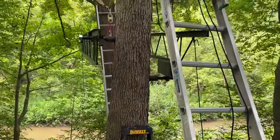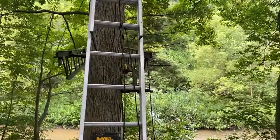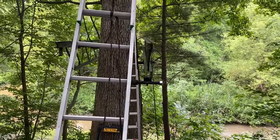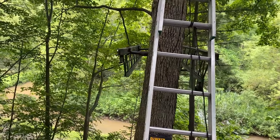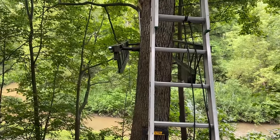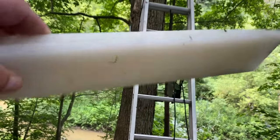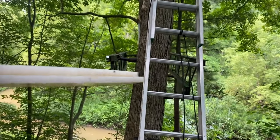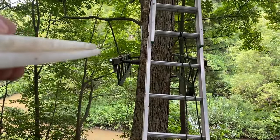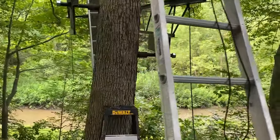So we had a little bit of an issue with the level of the trusses here, and they're kind of twisted. This right back here was low, and that left front is also low. So using some HDPE plastic that should be good for, you know, 100 years, for a shim up in the front underneath the bracket, and then I did this here with the same material.